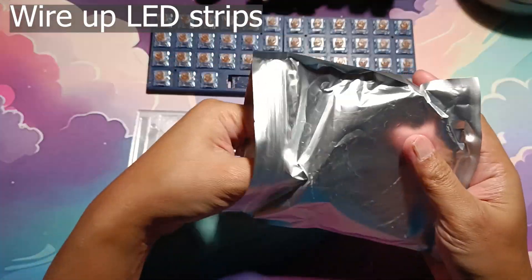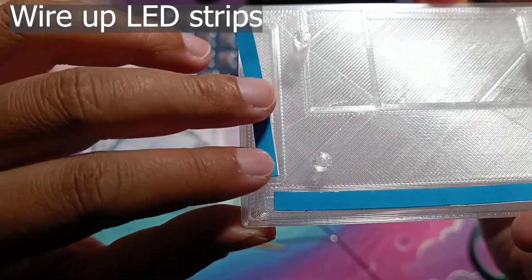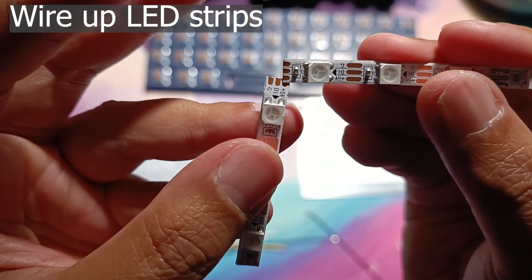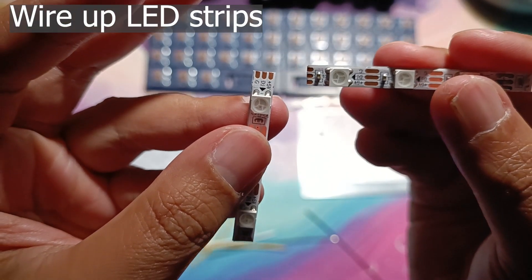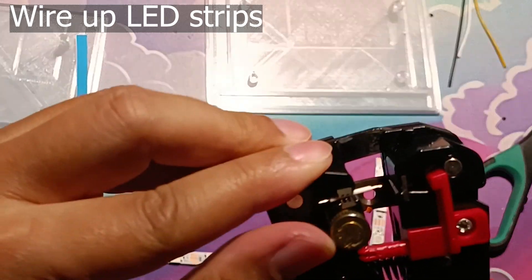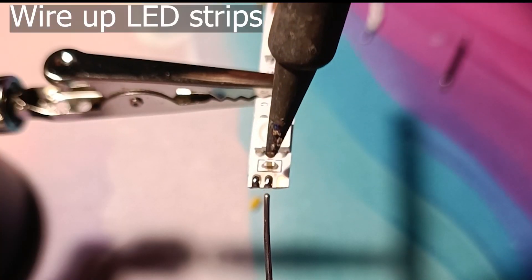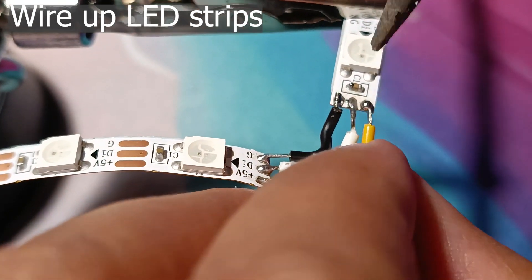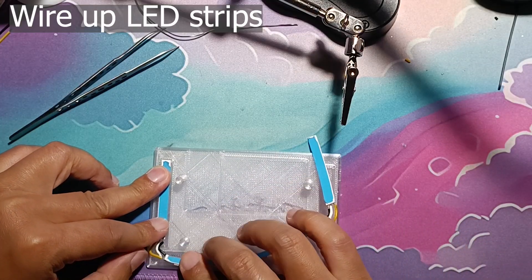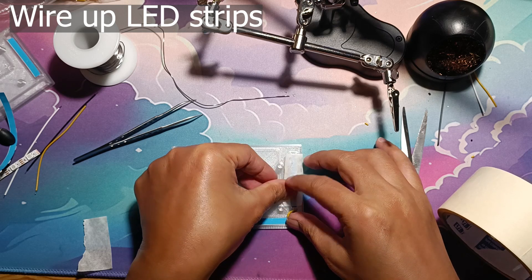Next is putting the LED strips into the bottom case. Cut the LED strip to 3, 6, and 3 LED lengths. Connecting the LED strip can be a challenge because the connecting wires are very short and need to be bent — also make sure the signal direction is correct throughout. Cut the wires to about half to one centimeter long, strip them, tin them, and tin the LED strip connectors. Then connect them all together. Putting the LED strip into the slot may require some wire mashing, so ensure the wires don't get pulled off. After that, secure the LED strips with masking tape.